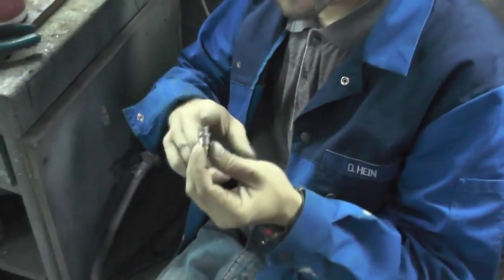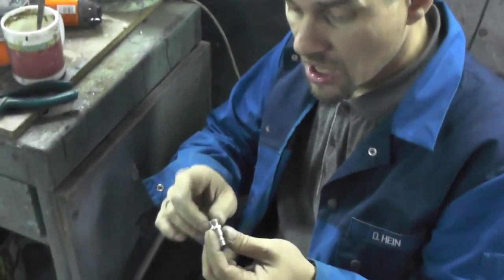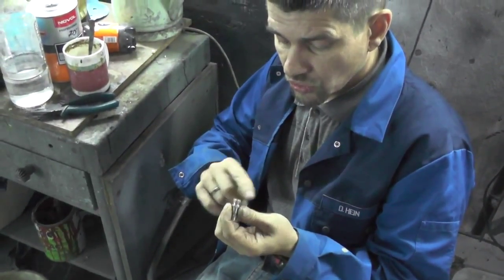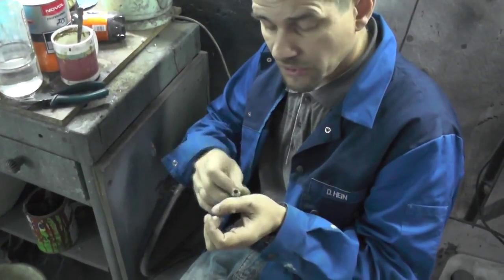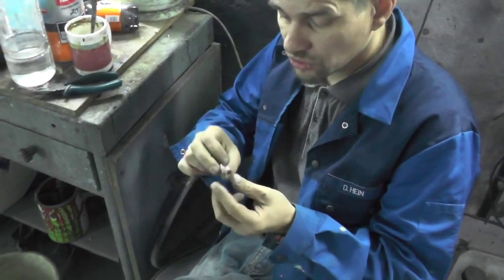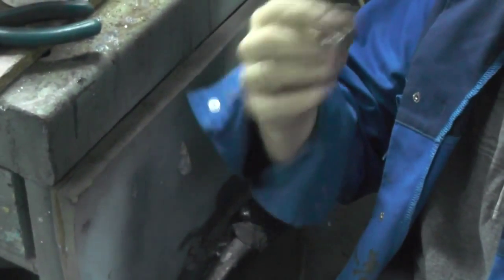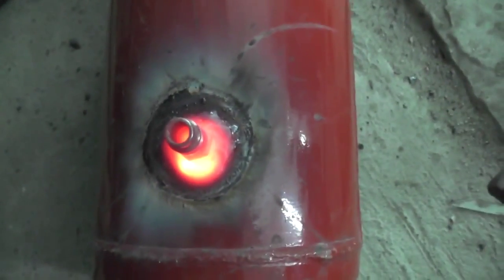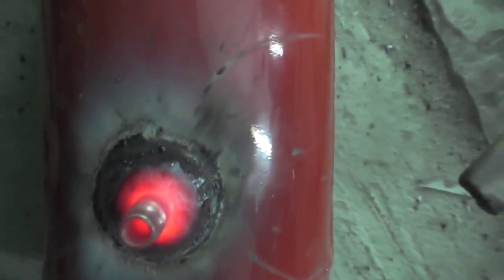Many of these connectors are often made of brass, and it also has a nice adapter. Many of these are brass ones — you can't weld a brass one, so you should check. Try to put it on a magnet: if it doesn't stick to the magnet, it means it is not ferrous metal. If it does stick, then you can easily weld it. Welding thoroughly here — you can see we have a hole that way and we welded it all through.